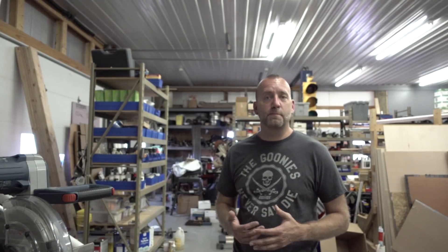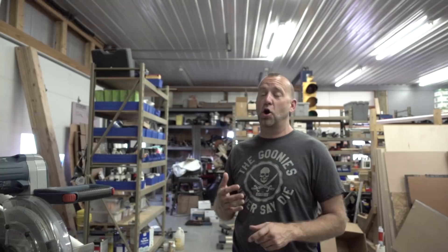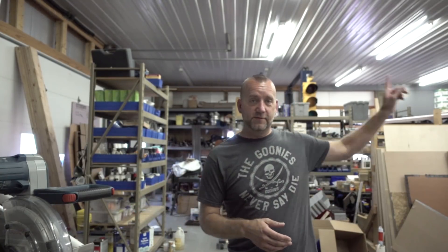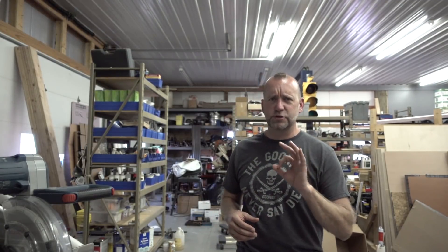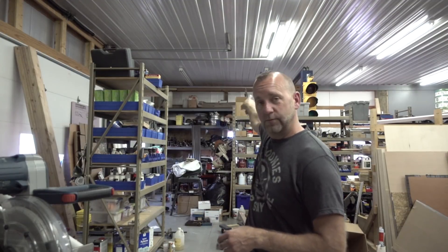The reason I'm switching is I am flat out tired of buying new ballasts. I lose anywhere from one to four ballasts per year. They've basically outlawed the T12s — they're going to stop making the ballasts because they are not energy efficient, and it's going to be harder to even get bulbs. Back there I have a fixture with a bulb that's starting to die — super dim — and my biggest problems are these two over here that have completely died, probably due to ballast failures.